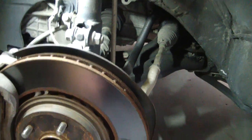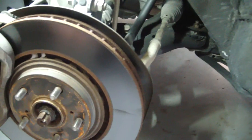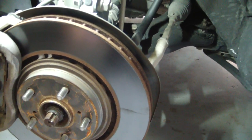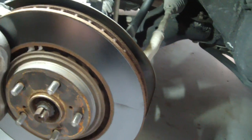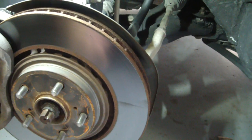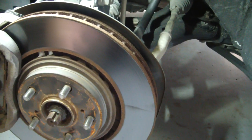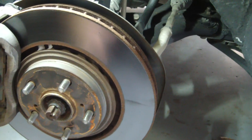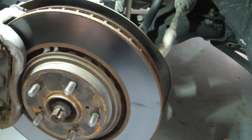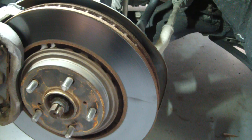What I think the problem is, I think the brake rotors are glazed, which means they've got hot spots in them, which are spots where the pads don't have the same gripping effect as on other parts of the rotor. And that happens when the rotor gets hot. You hit a mud puddle, water puddle, you splash water up on it. It literally work hardens, half a thousandth or a thousandth into the metal and creates what they call a glazed spot.